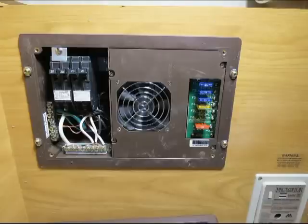So then you put the little tab on the main breaker, so it is locked in there as in the instructions. And then, as you can see in this picture, I put all the 12 volt fuses in their sockets, and I actually had two sockets that were left over. And because none of the wiring is labeled as to what it is, I actually went and tested each circuit independently, one-on-one, to make sure it was working.